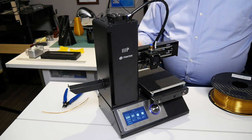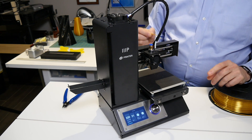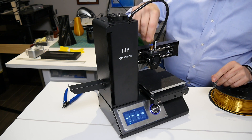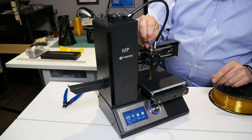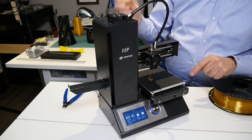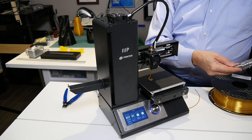Now what we can try next is to see if we can do this with only our filament tool. If the clog is not too bad, we can take a piece of filament, put it directly into the nozzle, and because you're directly in the nozzle, you can apply quite a bit more pressure than your extruder will apply. And if it works, your filament will come out directly there. However, at times the nozzle is too jammed for that to work.